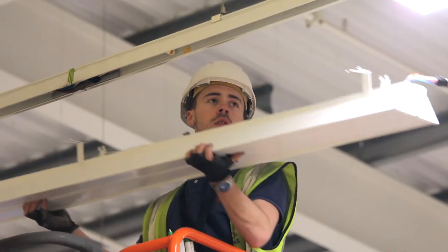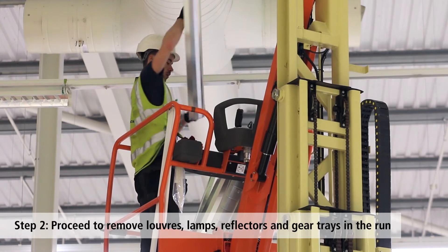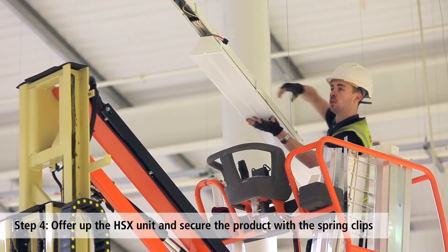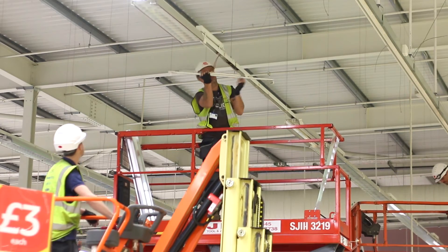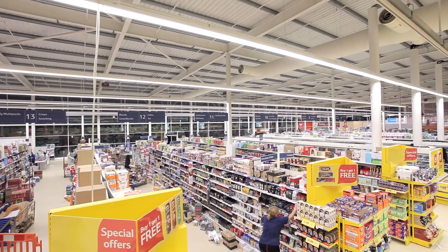Isolating a row at a time, taking all the original fittings down, then reinstalling the new lights and leaving them working for the store to operate with. What makes it easy to install is that they've been custom made to fit into the existing lighting trunking — you take the old fitting down, you've got an empty shell, and the new fitting slips inside it. You clip the tops over to lock it in position, plug them together, push them together, and that's it. Job done. Dream to install.